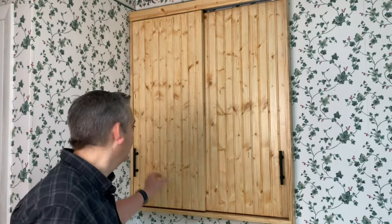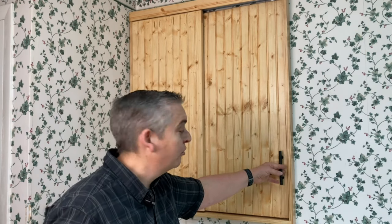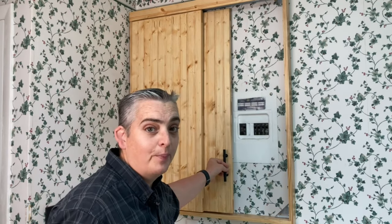Our electrical panel cover project is finished and I'm really happy with the way it came out. The stain matches the rest of the kitchen spot on, so it mixes in well and matches the aesthetics of the kitchen. It works great and serves its purpose. The only thing I noticed is the client requested we make it as close to the wall as possible, but in doing so we made it so close that the back door actually catches one of the screws for the cover of the electrical panel. It's not really a big deal — you just have to pull the door out a little bit and it slides right past that screw. In hindsight, I could have made the box maybe a quarter inch deeper and it would have missed that screw entirely.